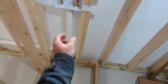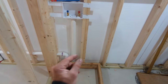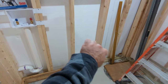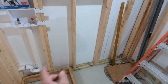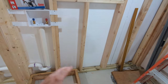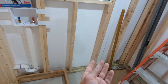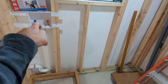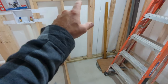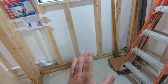So if it's a ton of water just pushing, solid pushing, evacuating, it's pulling a vacuum on this line that goes through this trap to the sink, and you can get it to suck down the water level in that trap under the sink, slurp it away as the washing machine drains, and it can dry up that trap, particularly because we are nowadays going into this independent tube for the washer. A lot of people's washing machine goes over into the sink and then down the sink drain, which we could have done here. It isn't the way you really want to do things if you can help it.